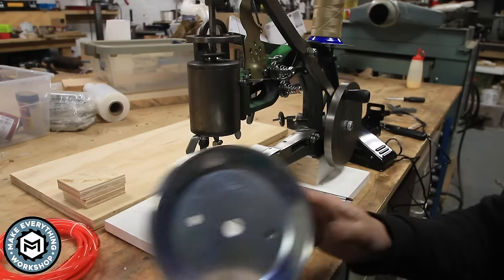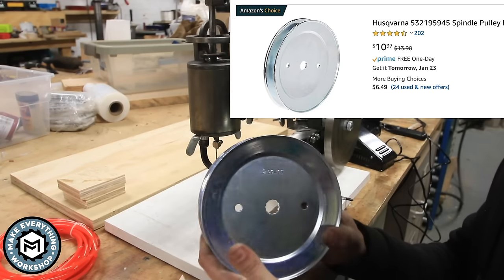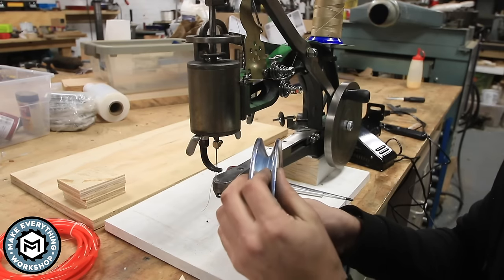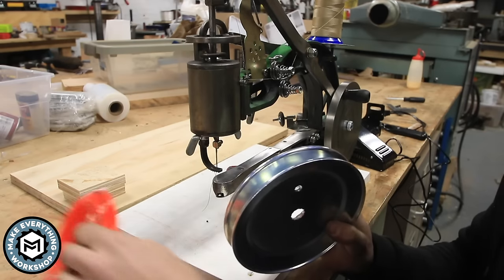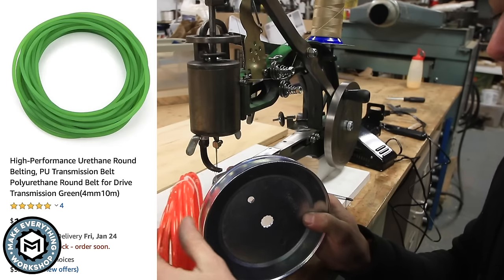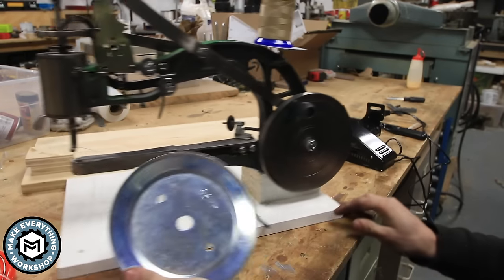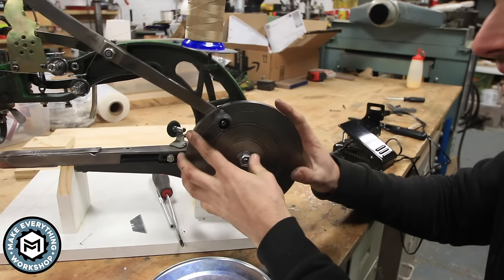Now, this pulley is from a Husqvarna snowblower, I believe, or a lawnmower. I'll put a link to all the parts from this in the description of this video. And what's important about this pulley is that it has a V groove in it that doesn't bottom out for a traditional V belt. So with this, you can use polyurethane belting that you can make your own length. This stuff we're going to heat up with a lighter and basically glue it to itself to make a custom length belt. And what's specific about this type of pulley is that it can be mounted right to the face of this wheel without modifying this wheel at all.